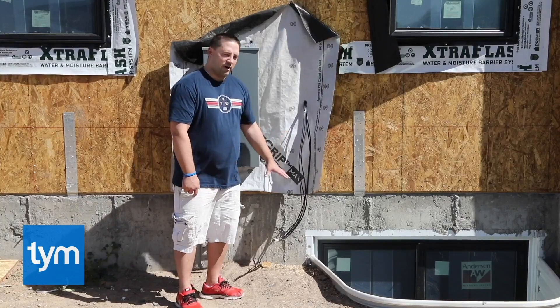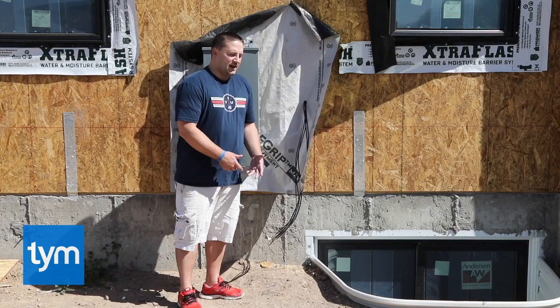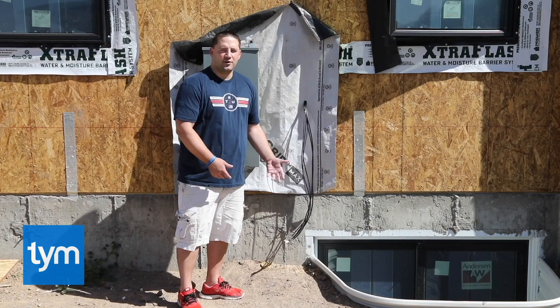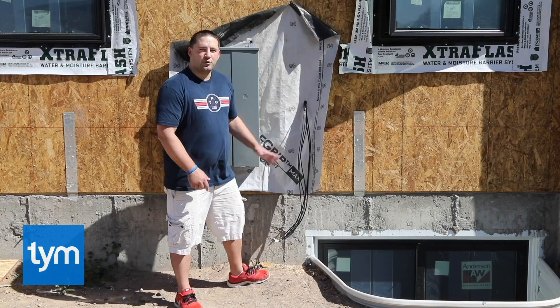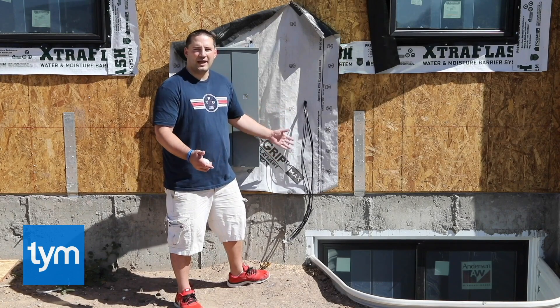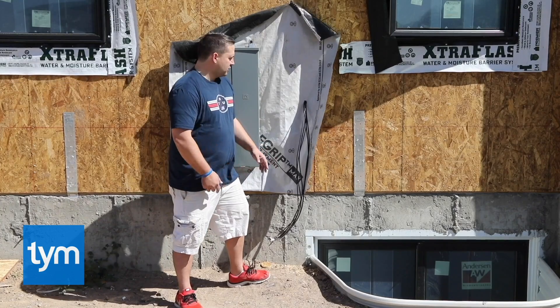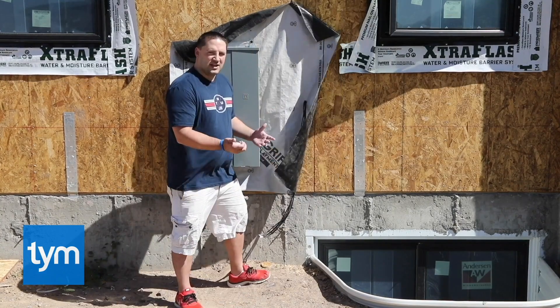I like it if the wire can't touch the ground. It's not a big deal, but especially in winter or when there's rain and mud, I like it if our wire isn't laying in the dirt. So we cut it just short enough that it can't lay on the ground. I also prefer it if the wires are all the same color — it just looks better on the outside of the home. They could all be white or all be black. Once we've got it out here and we know the lengths are good, we're going to coil it up one time into a loop and wrap it with tape to keep it safe and protected.